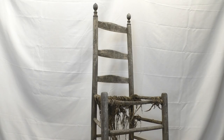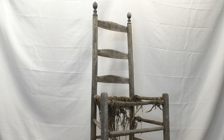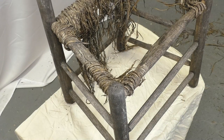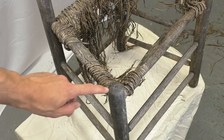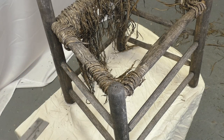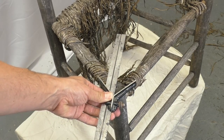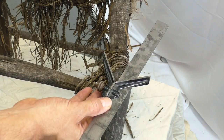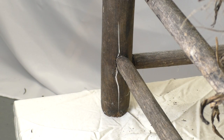From the outside, this chair looks simple, maybe even crude, but its construction demonstrates an intimate knowledge of both materials and physical forces. There's only a single flaw in the whole piece. Chair makers usually rotate their front posts so that wood movement is shared equally between front and side rungs, so none of the tenons poke into the wood at a weak point where splitting is likely. You can see this approach on one front post, but the other is aligned all wrong and you can clearly see how the post shrunk against the rungs and split. It was just a craftsperson moving fast and getting the piece out the door — clearly focused on quickly creating a product for sale while minimizing waste.